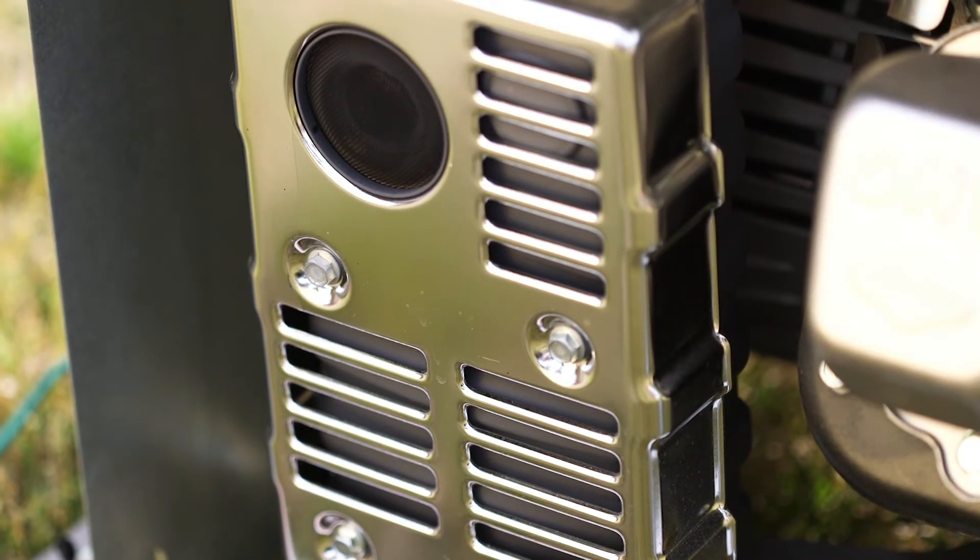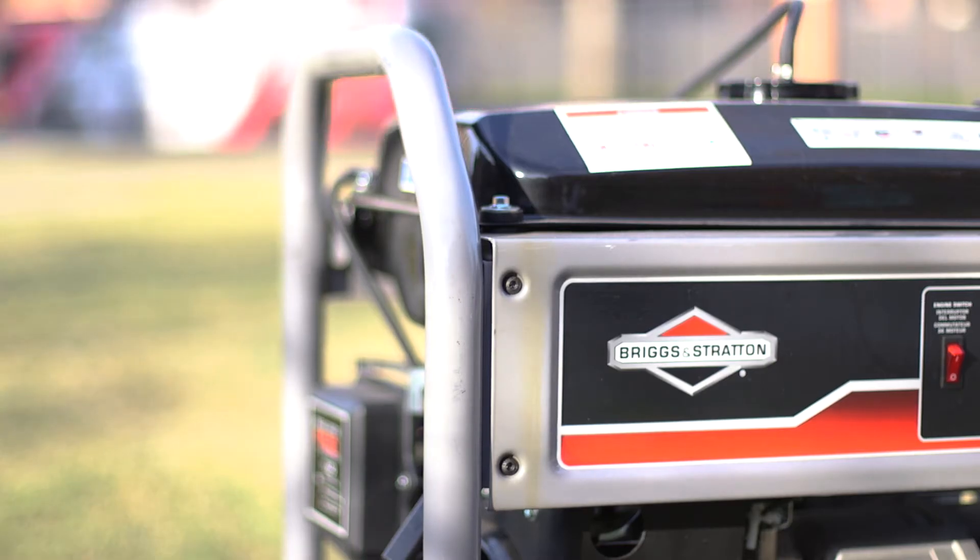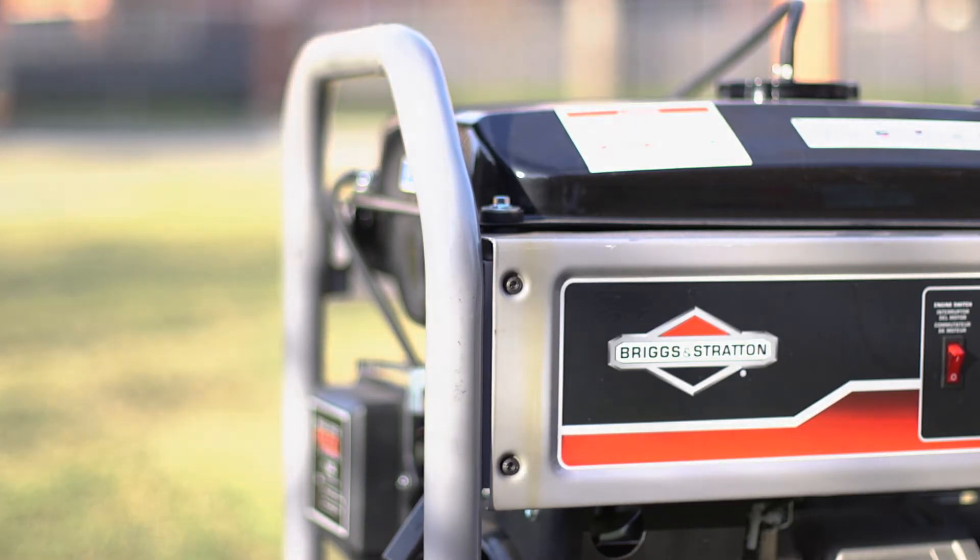Such obstructions are not always fireproof and the exhaust from the generator is very hot. Our generator does not require being grounded into the dirt but others might need to be. If you are using a new generator owned by someone else, be sure to inquire about this.